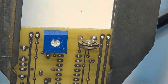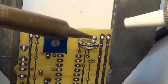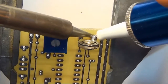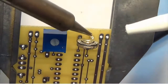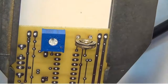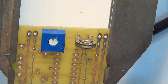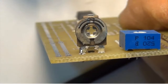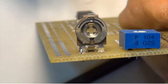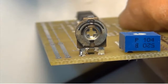Let's remove that blob of solder we don't want on this side of the circuit board. I wipe my iron clean, get my solder sucker, heat up the joint, and suck away. Wipe my iron clean again. It looks not too bad now. This is what the terminal looks like after removing the solder with the solder sucker. I can tidy it up a little more using solder wick. Everything's fixable — no such word as can't.